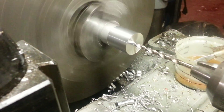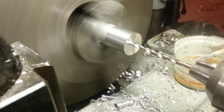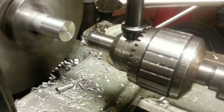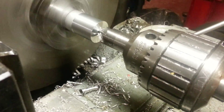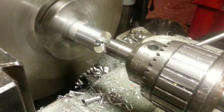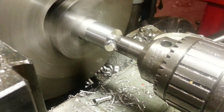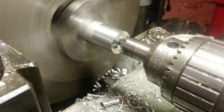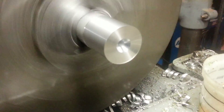The hole's drilled. Now I'll put in the countersink bit and show you how I countersink it. I got the countersink in the chuck. I run that right up into there, tighten down the tail stock, and then I go 90 thousandths deep. Okay, so that's 90. I loosen up the tail stock and pull it out — and as you can see, I have the countersunk hole.